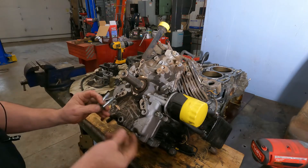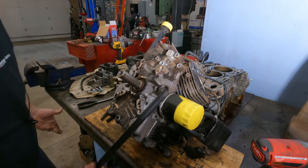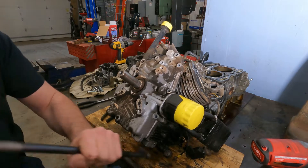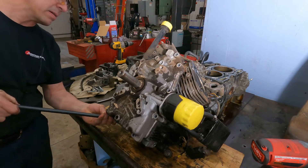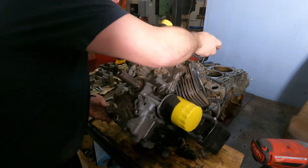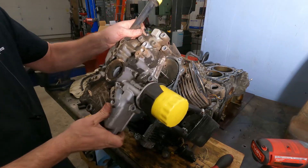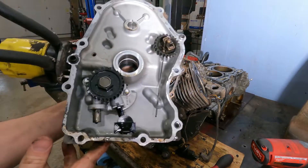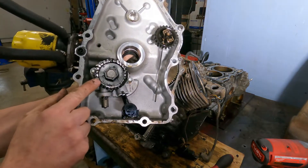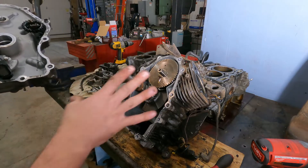Just make sure that all hardware is the same length. So this is a rolling wedge, or some people call it a lady slipper. And that came up nice. There's a little bit of a spot up here, but I'm going to just pry a little here. Just ease it out of there. There you have it. When we look in here, we see the oil pickup, the oil pump drive gear. That's probably a relief valve. And then we see the governor. All looks really good.